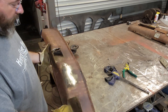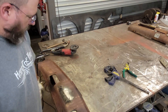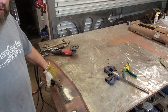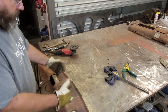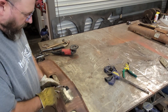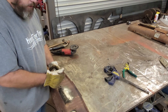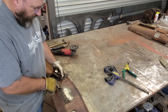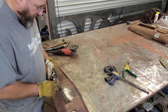That's what it looks like when the panel is done — pretty smooth overall. You could work it just a little more to get it 100% perfect, but before I do that, there's still the switch hole to fill in and two screw holes where the light was screwed on. I'll use that little tool to back the screw holes for welding up, which is actually what it's designed for. The switch hole is a bit bigger, so we'll actually have to cut another small piece for that one.